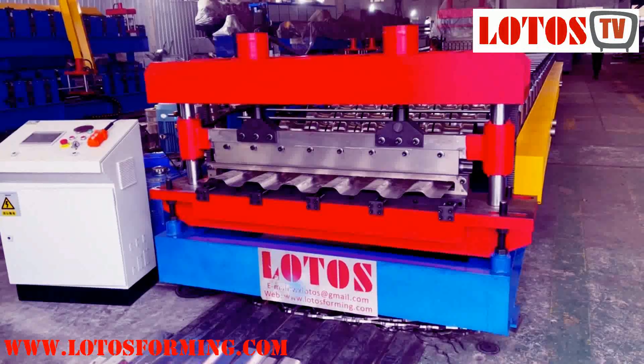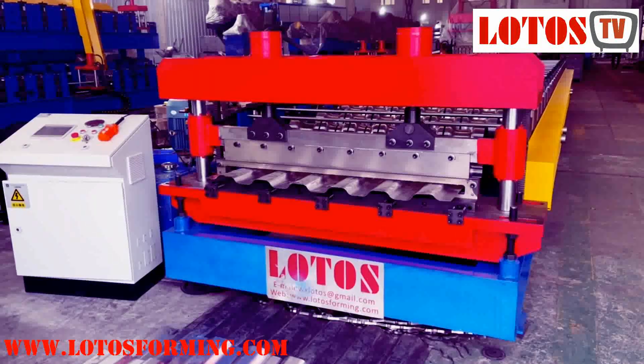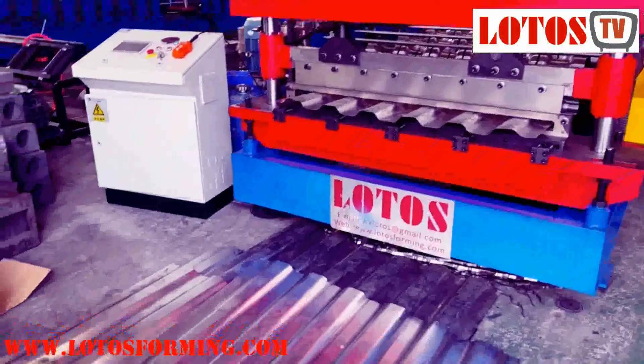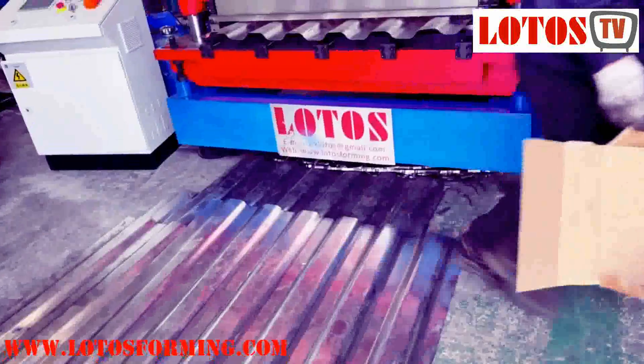Hello everyone, this is Victory. Today in the workshop we have one truck body panel machine which is ready. I'm going to share with you here — the machine and the product coming out from the cutting die. This is what we already tested in the workshop. This panel has a thickness of 1.0 to 1.1mm but the strength is about 500 MPa — it's high-strength sheet, and it's used for truck body frame.